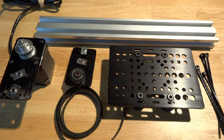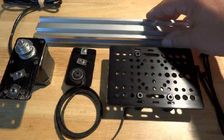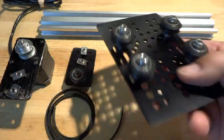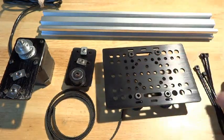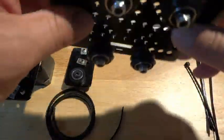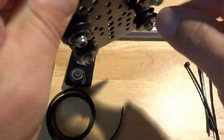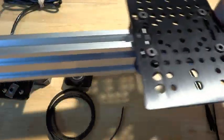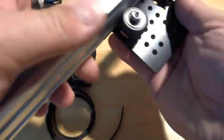In this video we're going to build a super simple linear actuator using V-slot, a motor mounting plate, idler pulley plate, some belt, one of the universal build plates, and some zip ties. It's pretty straightforward. I've already mounted the wheels — I have the eccentrics on one side and the standard spacers on this side. What we're trying to do is mount it along the top side; we'll put the motor on one side and the idler pulley on the other, with the belt through the center.